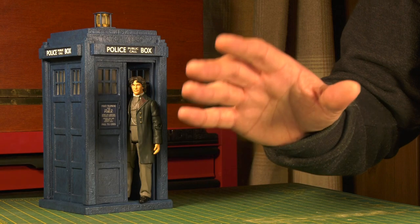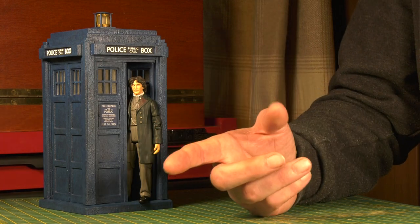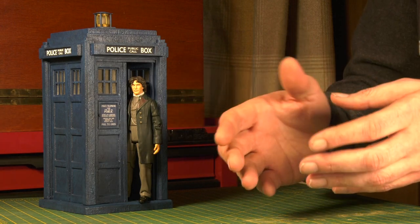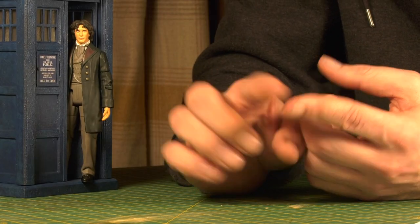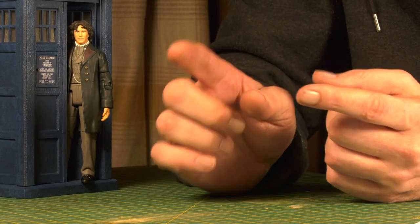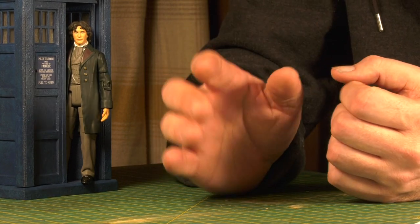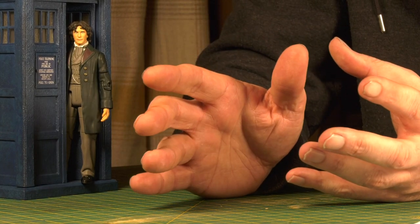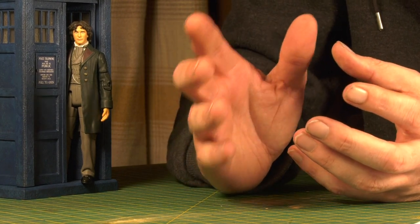Before I wrap things up here, I do just want to briefly touch on PLA, because I think there's a few things worth noting that you should bear in mind. Now, I do know that it's more stable in printing terms than ABS when it comes to warping and peeling off, but I am concerned by a couple of factors. The first is that despite it being a complete bitch to sand and that it wants to gum up even if you slightly look at it with sandpaper, I have noticed that it can be extremely brittle and often wants to delaminate along the layer lines, which can be somewhat problematic, so please do pay attention to that when you're post-processing.